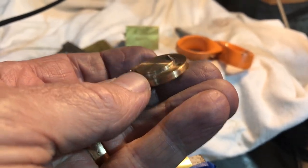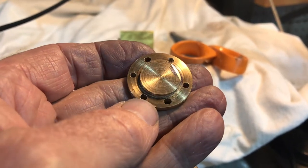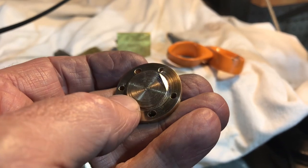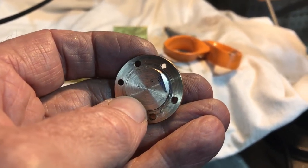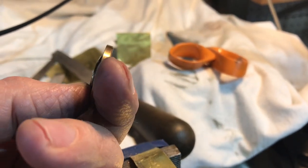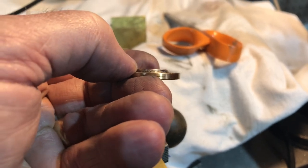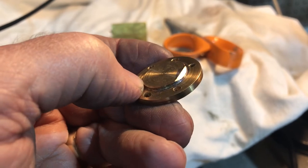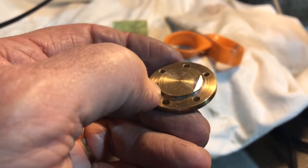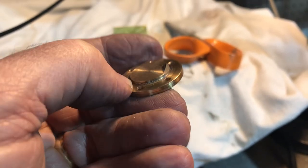Here's the finished product on one — you can see I just filed that little slant. I'm glad I didn't try to set this up in the mill. I think that'll give a little extra space for the gases if it's needed. There's still a little bit of a register there — still about 20 to 30 thousandths or so — to help seal the overall cylinder. So I think that's a good compromise and I'm pretty happy with that.